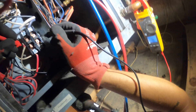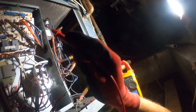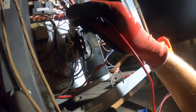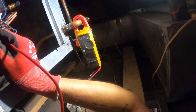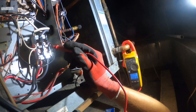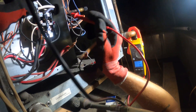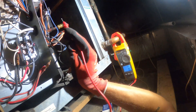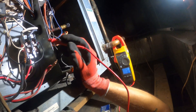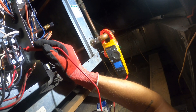I think the coil went bad on this contactor — that's why it's not starting. I put the meter on continuity: touch them together and we get a sound, but pulling the wires off we should have continuity and instead we have a thousand ohms resistance. The thermostat is calling, this wire off the board says 'comp' — that wire is sending out 120 volts and the other side of the coil has 120 volts, but between the two I have zero volts. They're coming off the same line — 115 volts on each leg but we need 208 across. Between here and the side of line voltage coming in: zero volts. So that's the same line.